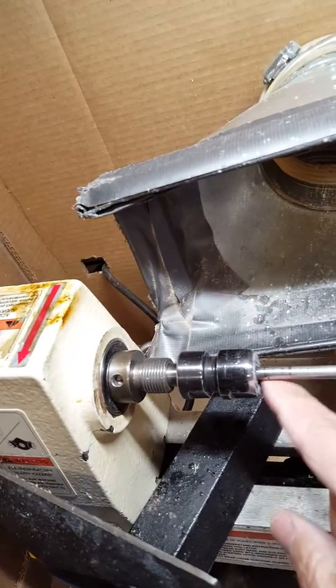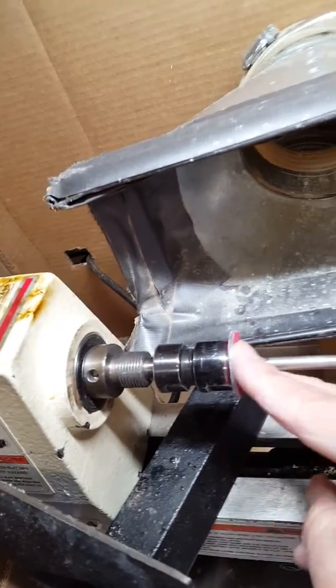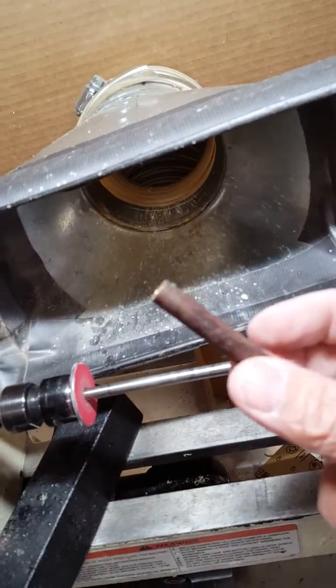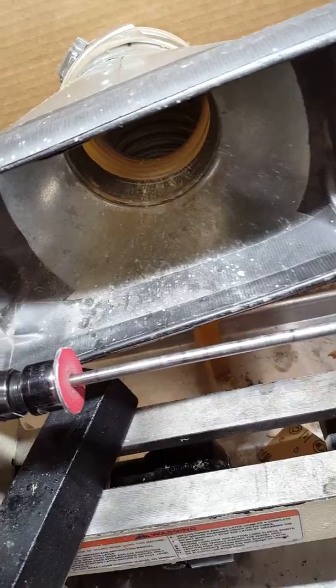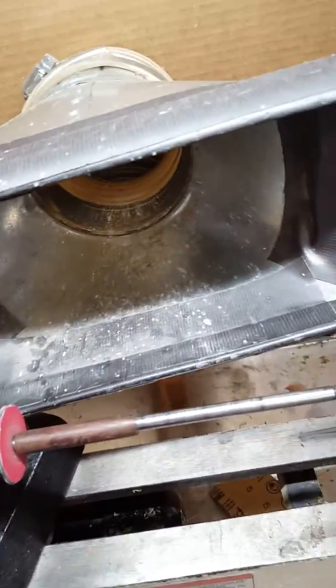What I've got on here is a piece of cloth electrical tape to give it a little bit of adhesion. Stick it on there. I've got my bushing here — that's 27/64ths for Sierra. Slide it on there. Turn the lathe on — medium speed will do it.